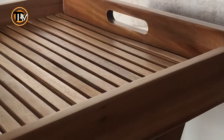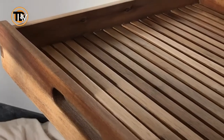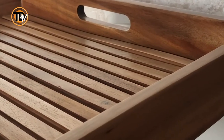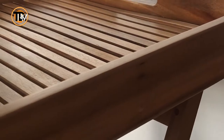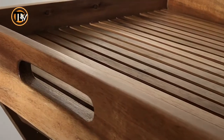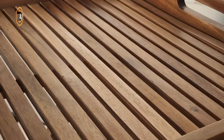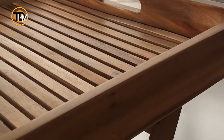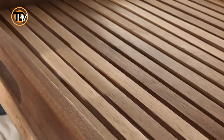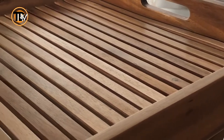Over the last two days this tabletop has now had three coats of the satin varnish, left approximately three to four hours between coats in a warm room. As you can see, the sheen level of the satin is quite nice — the timber stands out well. Overall it was nice to go on and even the first coat on bare timber had quite a sheen, which impressed me. I've decided to put the dead flat matte finish on top because I prefer the natural look without a sheen, though the table has already had its three coats and is UV protected.